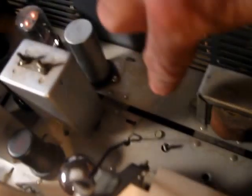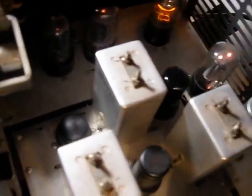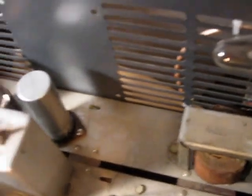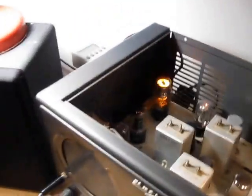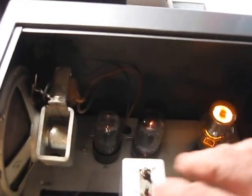The other really neat thing about this is, if you look in here, this whole section is isolated — you have an RF isolated ground in the center, and then they have, like an AA5 radio, the audio section mounted over here with a negative bus on terminal strips underneath, so it's wired that way. It plays. It's not a bad radio for what it is. I kind of enjoyed putting it back together.